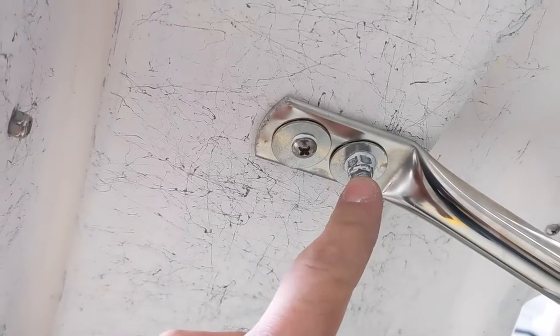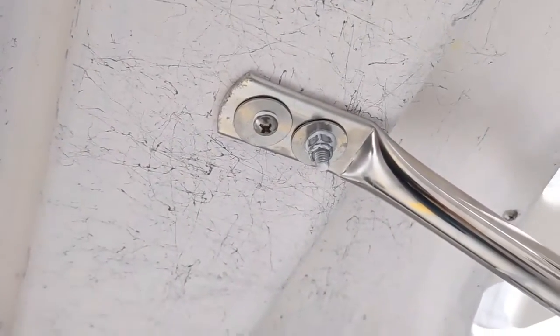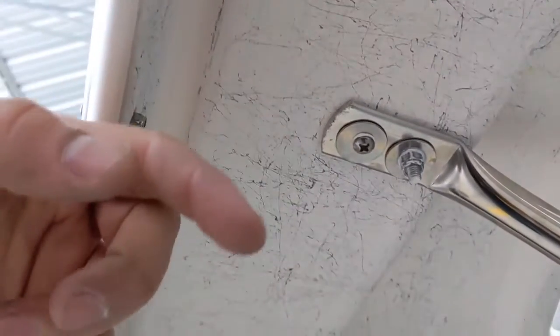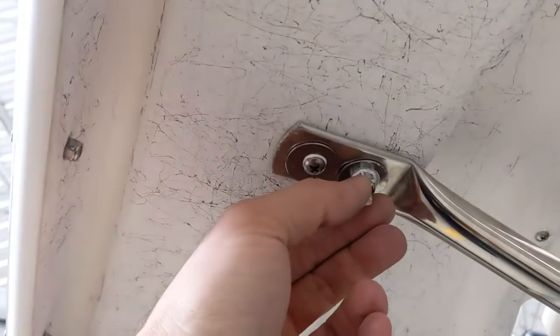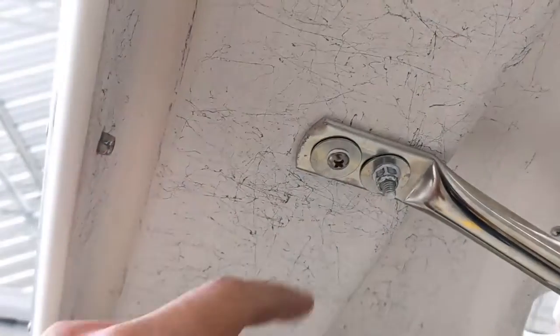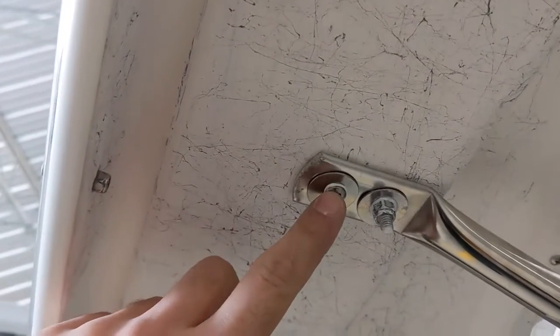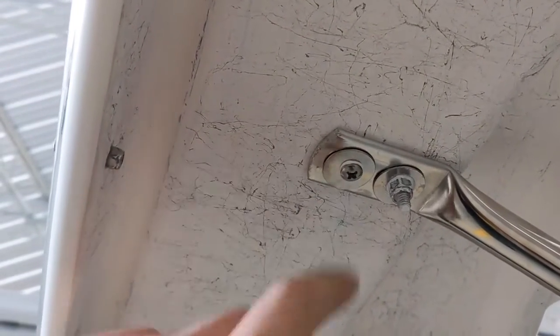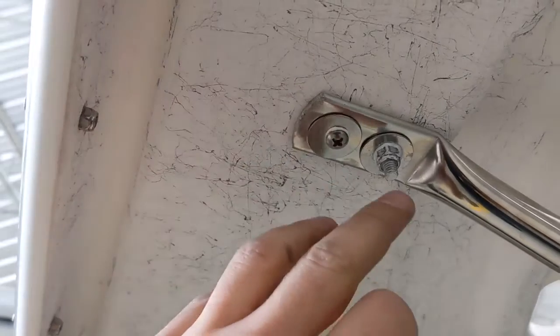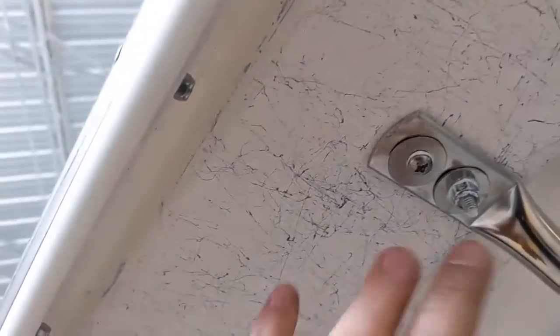I start with the bolt and put some 5200 all the way through the hole, put the Allen bolt in from the top down and snug it up with the lock nut and the washer. After that one is mostly snug, still with a little bit of room for movement, then put your wood screw in there and snug that one up. Then get this one nice and tight. I would go ahead and tighten it at this point and then tighten up your wood screw.